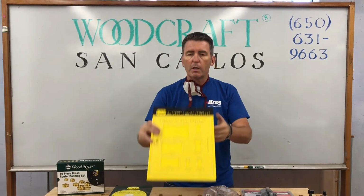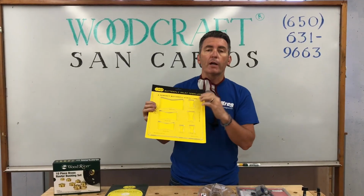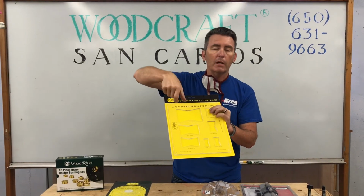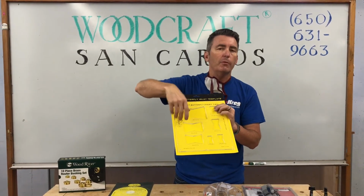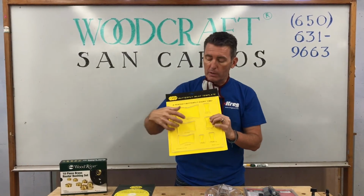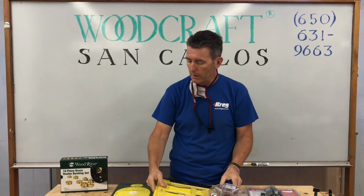There's also the ability to make what's called butterflies or bow ties. And there's these router sets that will allow you to cut these out, and it helps with cracks in slabs and other things. And it's very decorative, and so it gives you support in any of those cracks, and that's a very easy thing to use with the router.